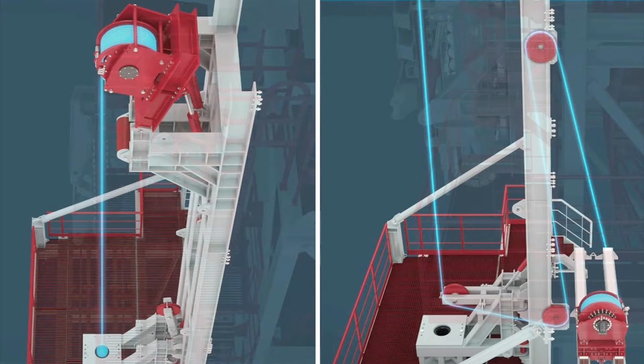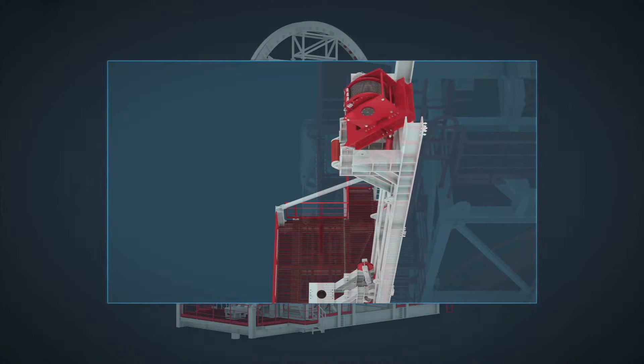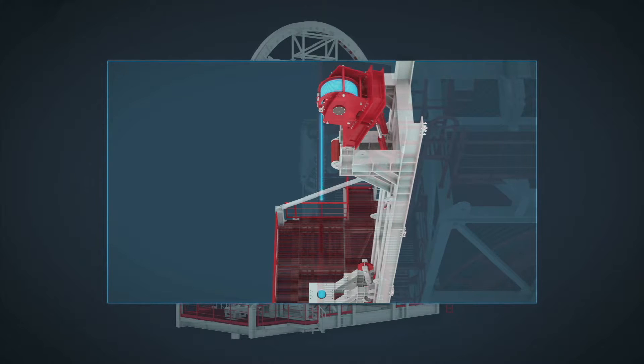There are two winches in the system: a five-tonne initiation winch and a twenty-tonne hang-off winch. The initiation winch wire can be threaded through the IDP so that both the leading and trailing end of the pipe sections can be managed with this winch, from the partitions in the reel through to the tensioner. The hang-off winch supports the weight of the complete string and is used to manoeuvre the end of the pipe from above the tensioner down to the deployment platform level.